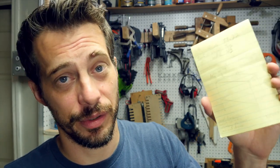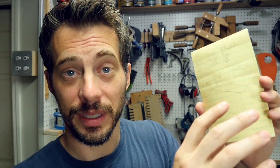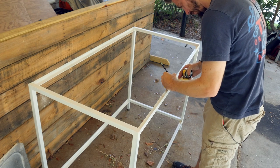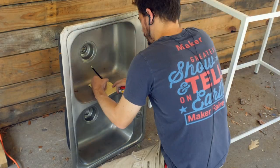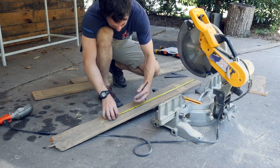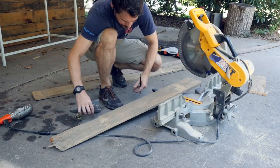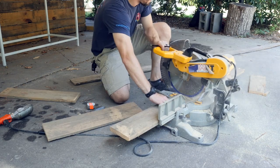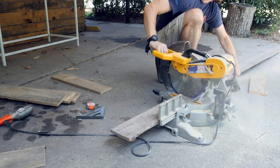In fact, this sketch is all I started with. I figured out what I wanted the frame to look like and had some basic dimensions, so now I'm just going to wing it. The top and bottom frames are the same size, so I wrote down those measurements and then I measured the sink — both the outside dimensions and the overlap on the back side, which is pretty important. I've still got lots of old pallet wood, so I cut down several pieces to match the depth of the cabinet. Based on the width of the pieces, I figured out how many I needed to cover the bottom shelf.